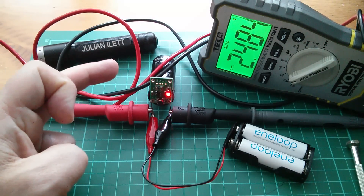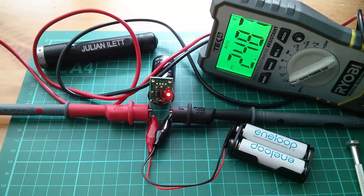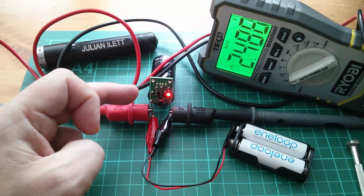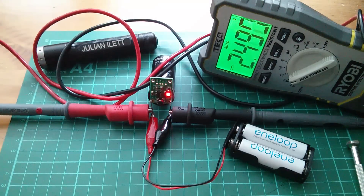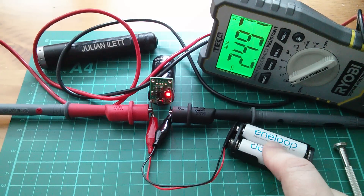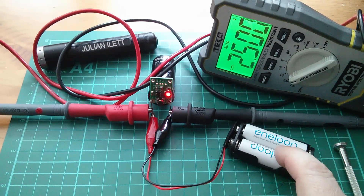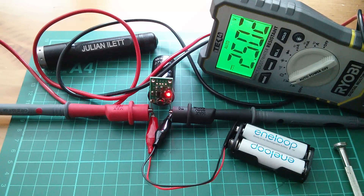The capacitor voltage is now approaching 2.5 volts. I'm not sure whether you can hear, but this boost converter is now making a whining, squealing noise at a frequency I can hear — so that can't be much more than about 10 kilohertz. The cells should hold 2.5 volts for a fair while, and indeed the capacitor is now at two and a half volts.